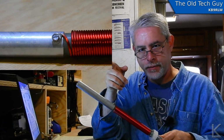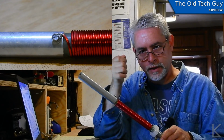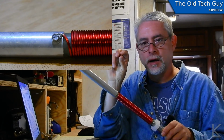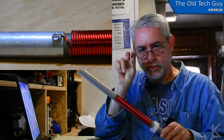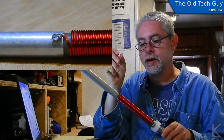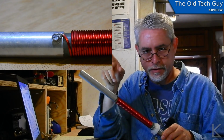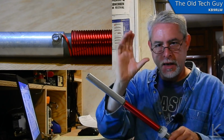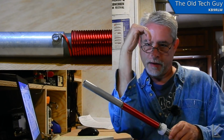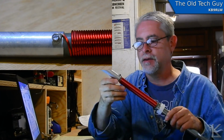They've got the wire wrapped counterclockwise. So when you turn the screw in to tighten it clockwise, it'll have a tendency to spread that little eye of wire out, unwind it slightly. You always want to wind a wire clockwise around a screw so that when you're tightening the screw, it has a tendency to pull that eye of wire a little tighter under there, and improve the connection, if anything.